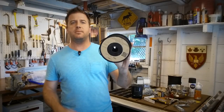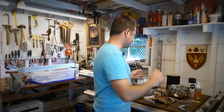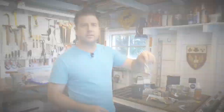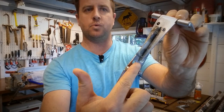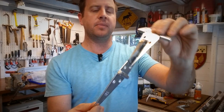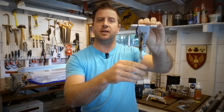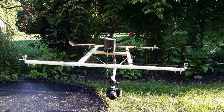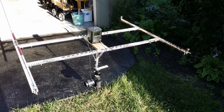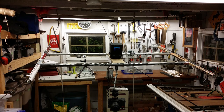Broken hockey sticks. 100 meters of Kevlar rope. 550 pound rated paracord. Steel brackets, nuts and bolts, screws, and steel channels. Little pulleys — some smaller ones. Two fence hinges; I cut a slot down one, fit them together, and then had a friend weld them. I'm going to hang my camera from this and it'll allow my camera to pivot but it won't allow it to twist. That way while the cable cam is running along the cables it's always going to be level no matter what orientation the actual cart is on. Altogether the materials probably cost me $100–150 or so.